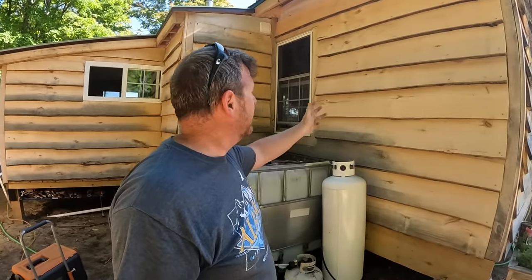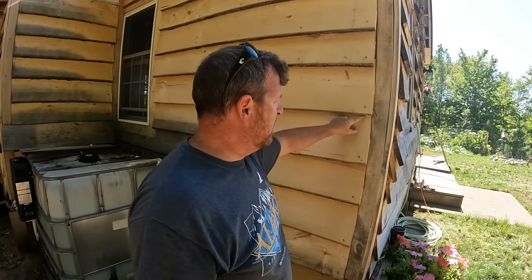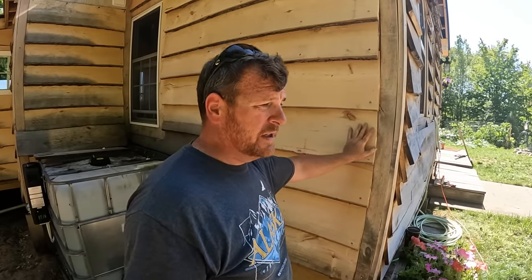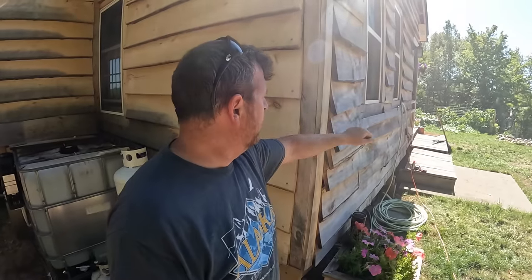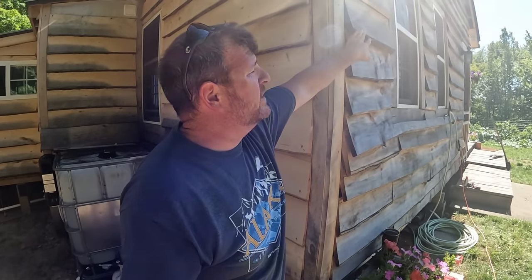When you put the live edge siding up green, when we just milled it, I only nail the top when we put it up underneath, and then you let the bottom hang out and let it dry and shrink, and sometimes it curls. A lot of times it's curling. So before it gets old, like this stuff in the front and hard as a rock, I didn't do it to the front, and the front is peeling up, but I could still push a lot of it down.